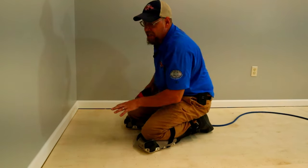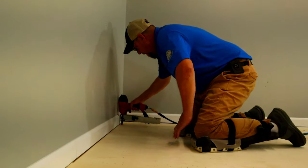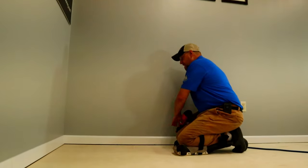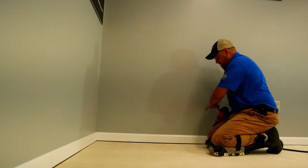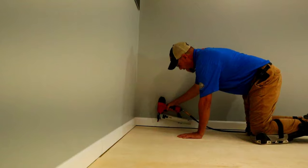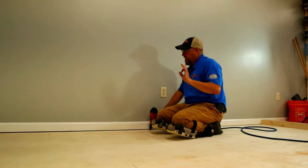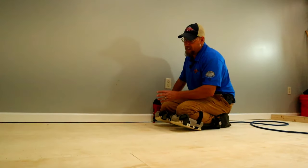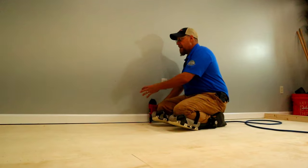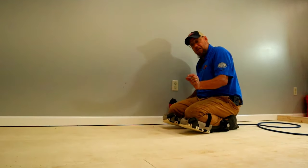Right here on the edge, I'm going to treat the edges just like a seam — going about every two inches with the edge nailing just like I do on the seam. Over here on this edge where I did my random field pattern, I'm going to come back and go every two inches on my far edge. It cannot exceed two inches — if you get an inch, three quarters, inch and a half, that's all fine. Just do not exceed two inches between your staples on an edge or a seam. And you want to be about a half inch in from the edge of your board.